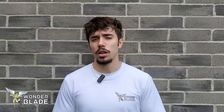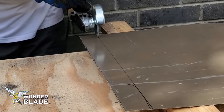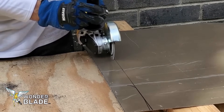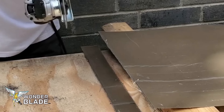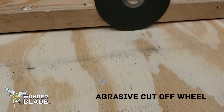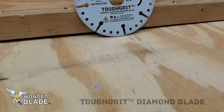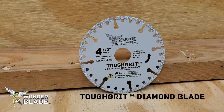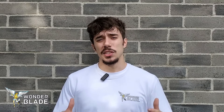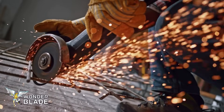An angle grinder is also a universal tool for cutting. Even if you have to cut down a piece of sheet metal, that is where an angle grinder again comes in handy, and you don't have to pull out any special equipment. With angle grinders, there are two types of wheels: you can get an abrasive cutoff wheel, which is a popular choice for cutting through metal, and then you also have a tough grit diamond blade, which is also effective for cutting through metal and many other materials. With an abrasive cutoff wheel, they tend to produce a lot of sparks and debris, and what's causing all those sparks is not the actual metal but the wheel itself.